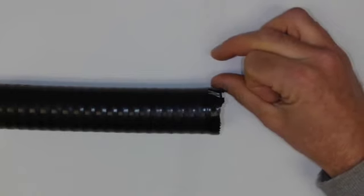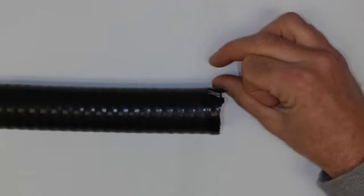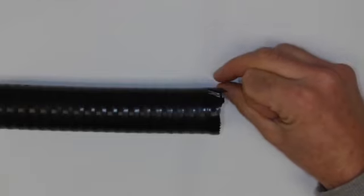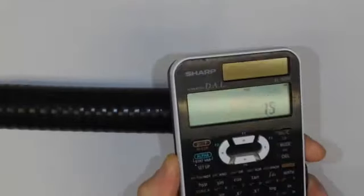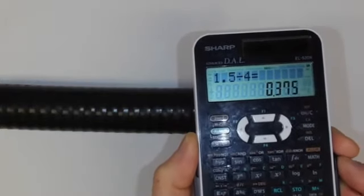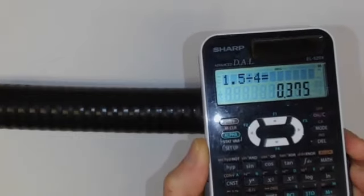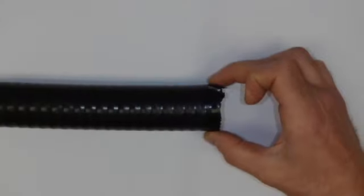Less than 100%, all the way down to 25%, we could do a quick calculation to determine what that would be. And then less than 25% would be like the conductors almost together. So 1.5 inches for 25% spacing. I'm just doing it on my calculator here. 1.5 divided by four, that would be 0.37 of an inch. So we're talking like really small, right? Not a half, but 3/8 of an inch. So they're talking about distances that the cables can be apart.